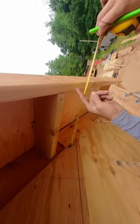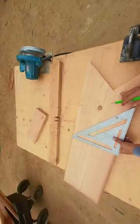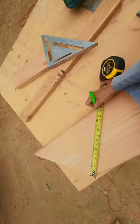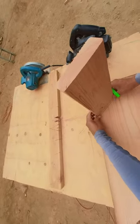I'm going to do this shed roof — it's going to go all the way across. From the plywood to the inside I have 16 inches, and I'm going to put a ledger here, so it's going to be 14 and a half. 45 degrees, 14 and a half, 45 again. This is my fascia — I'm going to put it right on the line.